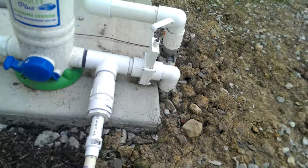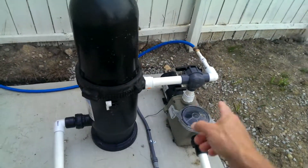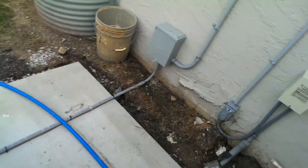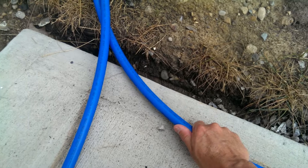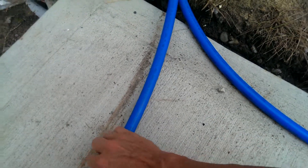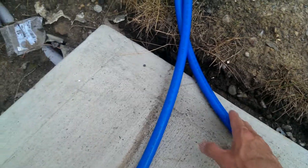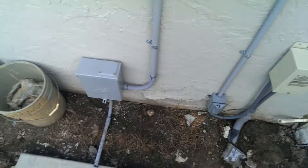The way I know it's working — you can play with the diverter valve when you first start out and try to figure out where your pressure point is. What I'll do to make sure it's working: I'll grab this pipe, which is the cold in, and this pipe, which is the hot coming back into the pool. If you touch these two you can feel it — when the cold goes up and the hot comes down, that's when you know you've got the right amount of pressure, because it's shooting cold up and hot down.